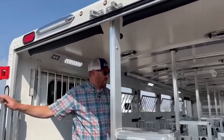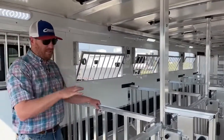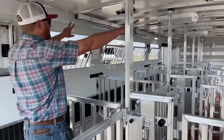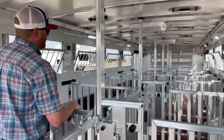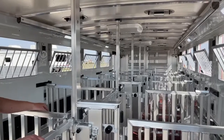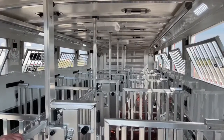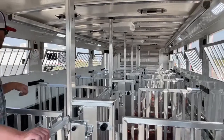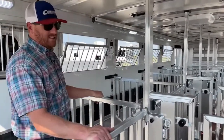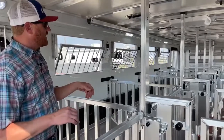More head pads as we come into the stall area. First and foremost, again this is a 12-pin setup — these are adjustable, so 60-40 or 50-50 setups. You'll also notice on the roof the two tracks, and stored up against our partition wall is a traveling gate. So now if you wanted to use this for some show cattle, he can remove some pins and then roll that gate back and set it between each window. There are locations to lock that gate into. I could remove all these pins in this trailer in about 5-10 minutes — putting them back, you're more like 15-20 minutes just to get them lined up exactly how they need to.